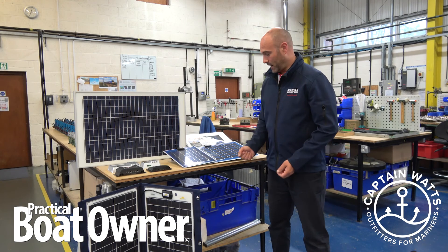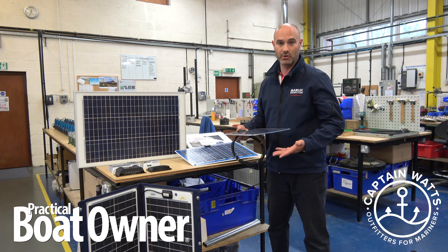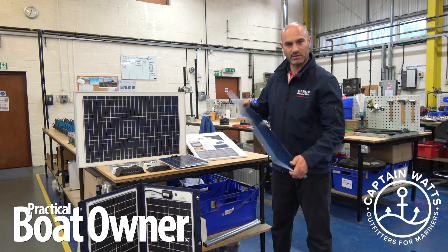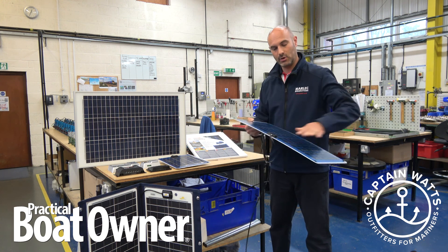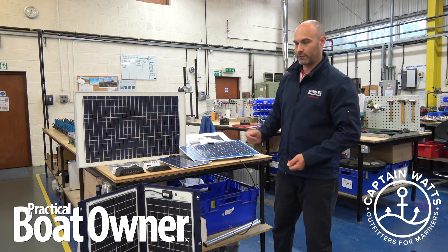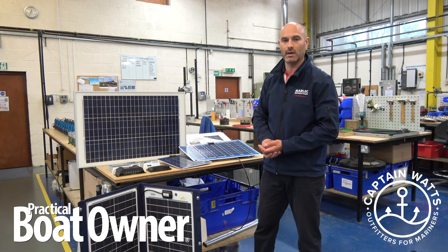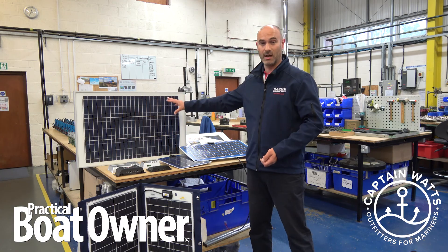So there are different sizes of solar panels. Here is a 10 watt, which would be used for just trickle charging your batteries — a couple of watts here and there — just to stop them from completely deep discharging. Right up to a 30 watt semi-flexible panel, and these panels can be mounted on the deck of the boat. They will bend slightly so you can actually walk on them, as long as you have a solid surface underneath. And then we go through to a more traditional glass solar panel, which is great if you have a location out of the way — perhaps a gantry or a goalpost type of system to mount it onto — because if you walk on this, obviously you've damaged the panel, because there's glass on the front of it.